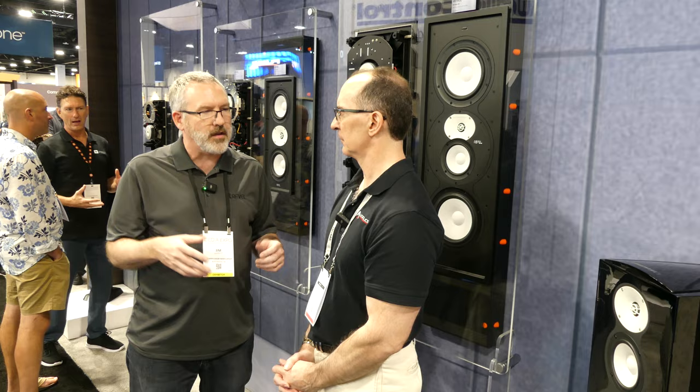Is there a separate charge for back boxes — an upcharge if you just buy the in-wall? Yes, we sell them individually so you can buy the speaker module and the back box separately. You don't have to have the back box, but many people will want it for consistency and noise isolation from the next room. If you're going to put it in a standard stud bay enclosure, I'd suggest the glued-and-screwed method to get a good enclosure out of a wood frame stud wall with drywall. That said, we're actually demonstrating them on the other side of this wall here without back boxes.